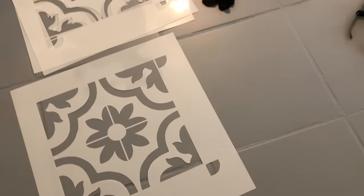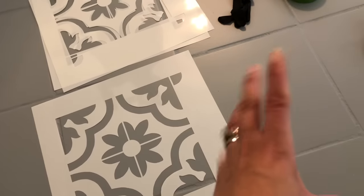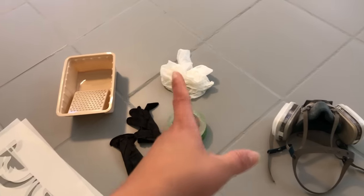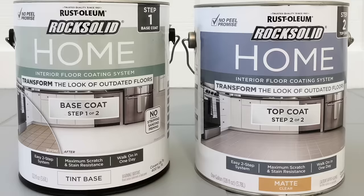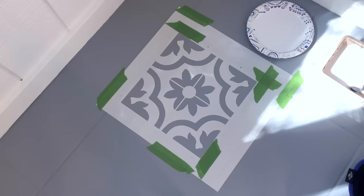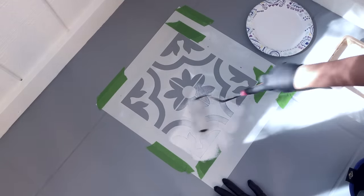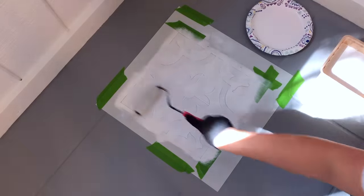I was not done — I ordered some stencils because I wanted the floors to look like cement tile. I got a beautiful pattern, which I'll link in the description box below. For this you will need a small roller tray, gloves, painter's tape, a damp towel in case of mess-ups, a mask, a four-inch foam roller, and a paper plate. I used another base coat for this application, this time in the color white. I centered my stencil on the tile, applied paint to my roller, removed any excess on the paper plate, then started applying it through the stencil.